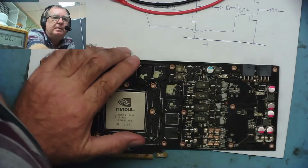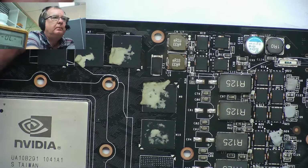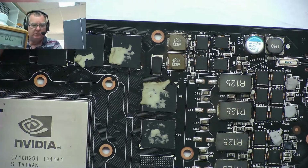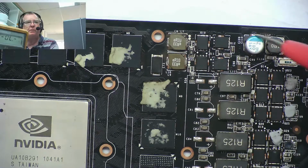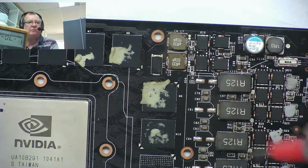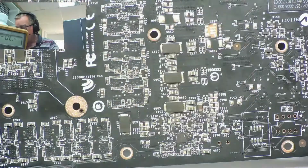So let's have a look to see where this actually comes from. I'll just zoom in on this a little bit again. Okay, that's a good amount of zoom. So we can see now the coils, the MOSFETs, two for each one. This is where the 12 volt was coming in through a filter. This is on the 12 volt rail, it's a 16 volt capacitor, so that'll be on the 12 volt rail. But I can't see any controller chip around here. In fact, I can't see any controller chip for the other one either. So I'm guessing they're going to be on the back of here, yeah?